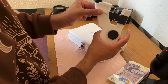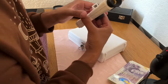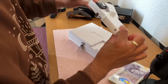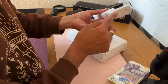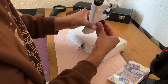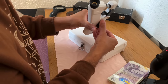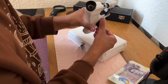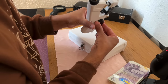You can then place your spectacle lens there, slowly release, and we have nice attachment in there. Inspecting the piece — there don't appear to be any problems. There's a little external slot there, but I don't see any cables; it can be powered by batteries as well. Checking the scale — it runs to plus 15.5 diopters, denoted by the black scale. The negative scale is red, running to minus 15.5 diopters. All looking correct and in order.